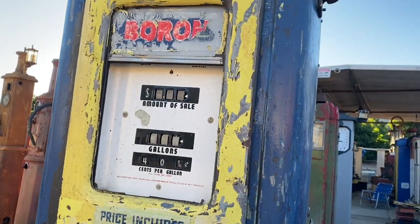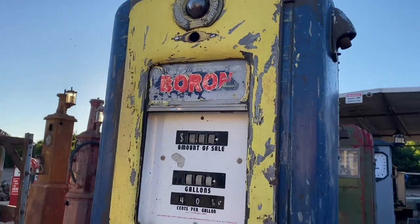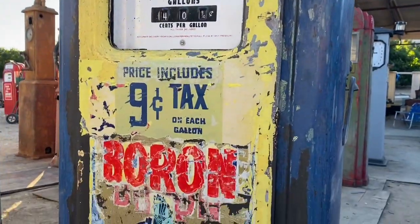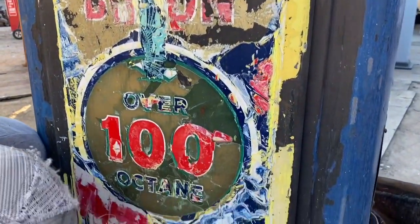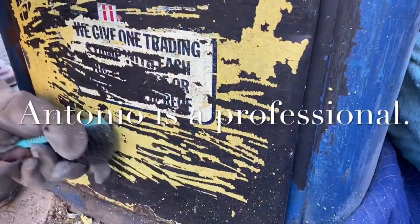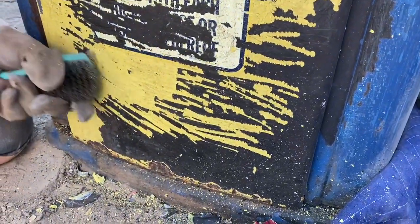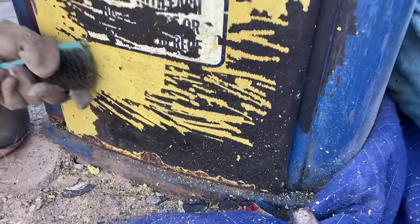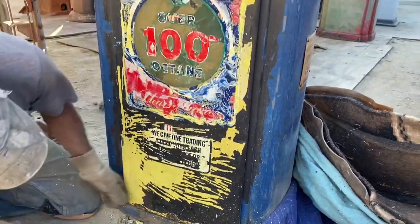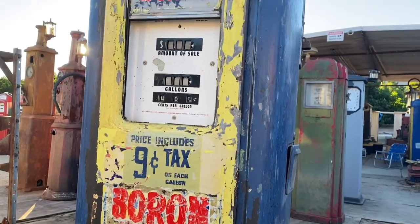There are several different techniques to bring back an original finish. This time we decided to go with the scrape and peel approach. I've seen people use chemical strippers. I've tried that in the past. The reason I don't like using chemical strippers is not only the fumes, but the fact that a lot of times the stripper will eat away at the decals to where decals lose color and depth.